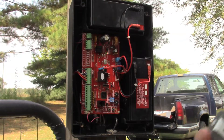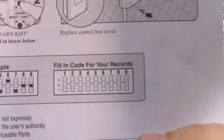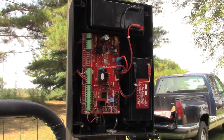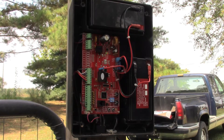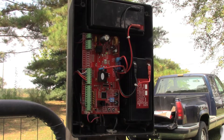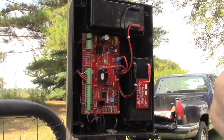Now let's set our personal transmitter code. Inside the kit you get these little transmitters — open them up with the two screws on each side. Inside you're going to find some dip switches. You can set them to any position you want, but I'd definitely recommend changing from the factory setting. If you get another transmitter, just set it to the same dip switch settings and it'll work fine. To program it, hit the Learn Remote button, press and hold it until the alarm sounds, then press and hold your transmitter button until the alarm sounds.